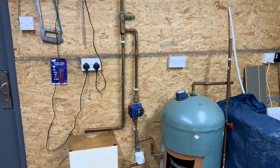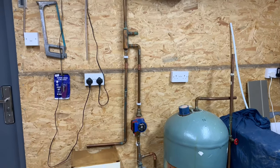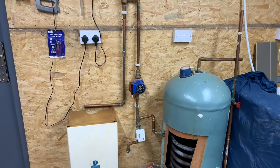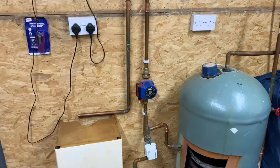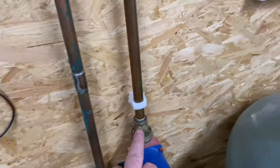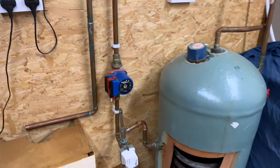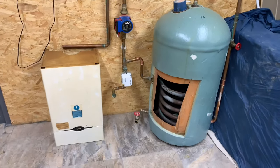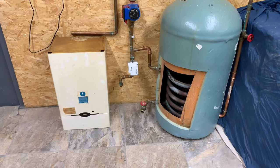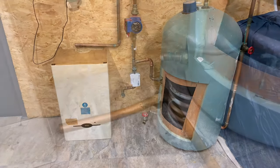That's a rough idea of how the flow part of the system works. In practice, for a new installation it wouldn't comply like that - you'd need to check your book. I would do it as OCP: open vent, cold feed, pump - all within 150mm of the pump. Now I'll move on to the return and show you how that works and what you need to do if you're going to cut it out and put a new boiler in.